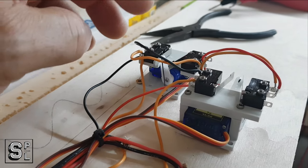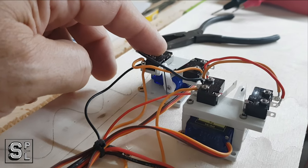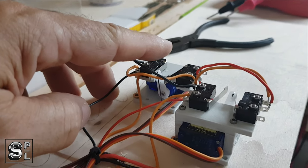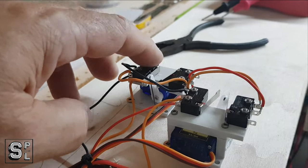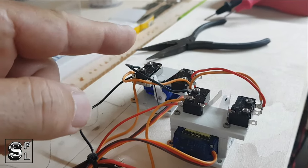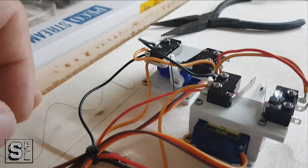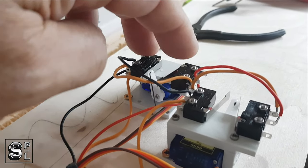Note, this is supposed to be done with one micro switch, but in the past I had issues where the horn would still be moving, and the polarity would have switched, but the blade on the point would still be in the first location, and they would end up shorting. So to cut a long story short and avoid a lot of problems, I used both micro switches